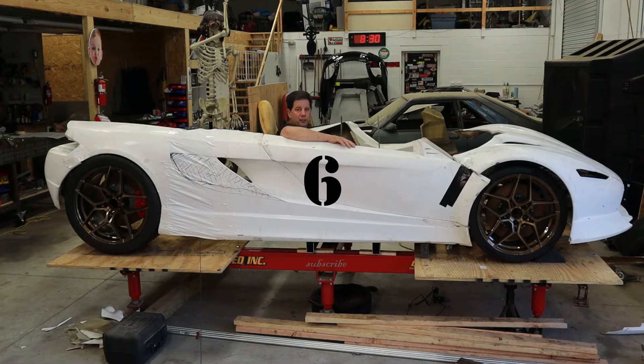What I'm going to have to do is think of a new way to mount that front end — probably cut it off and re-weld it. But I also think I can maybe get an inch or two just by moving this firewall back. I won't know that until I actually get the engine mounted up. There is quite a bit of space between the firewall and the motor, so I think that's the first thing I need to do — get the motor mounted and see if I can move this firewall back before I start hacking up the front end.